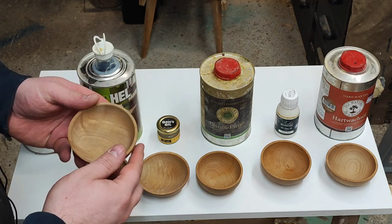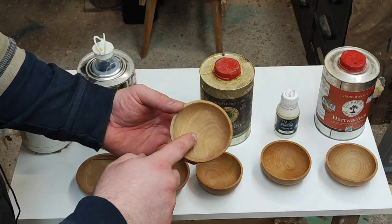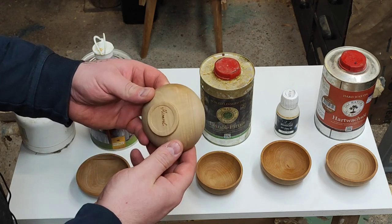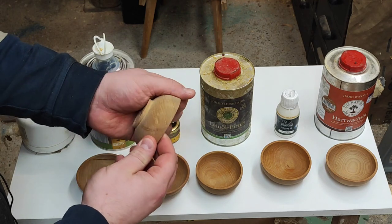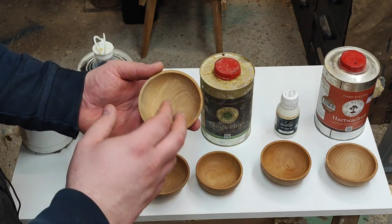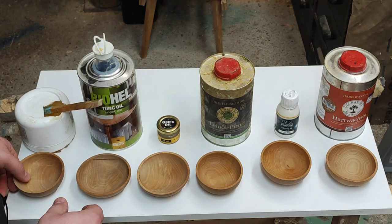Now for me there is not too much of a surprise or anything like that, because I'm not sure if you could see this, but there is still a visible mark where the coffee was, and after one wash with soap and water, it's completely removed all of the color enhancement that you get with the oil. That just goes that mineral oil is an evaporating oil, not a drying oil. That's a key difference to remember.